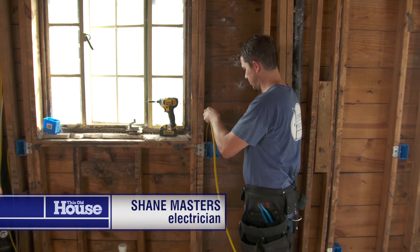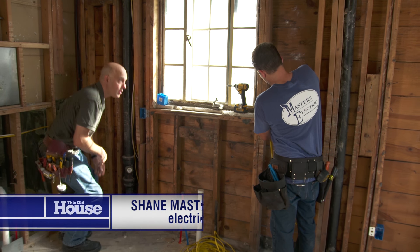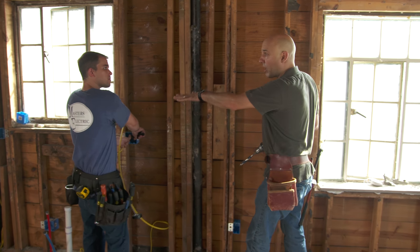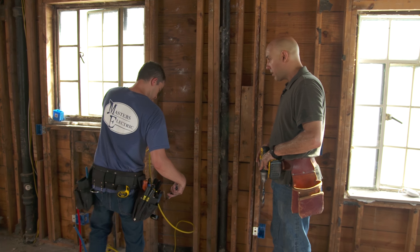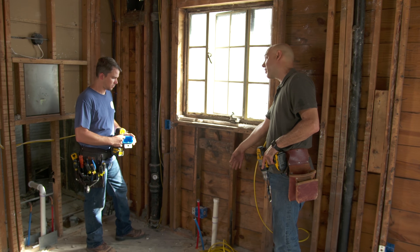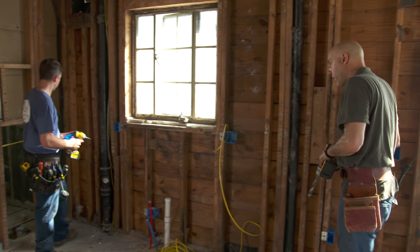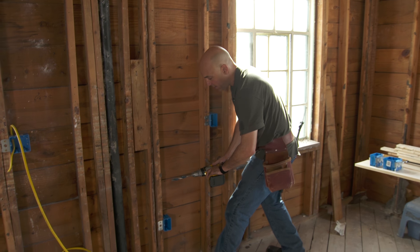Getting these countertops wired up - let's get some holes drilled over here. On the other side we have a countertop space and another outlet to put in for coverage. Down below, we wire a 14-2 to the dishwasher and a 14-2 to the garbage disposal, same as we normally do. We'll drill a couple holes and get this box mounted.